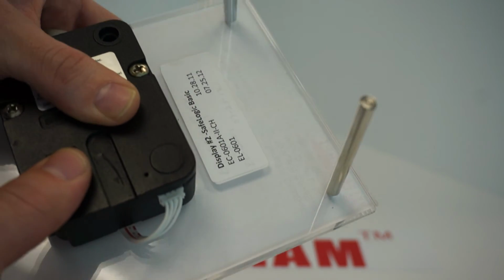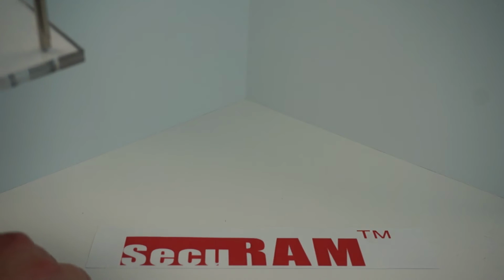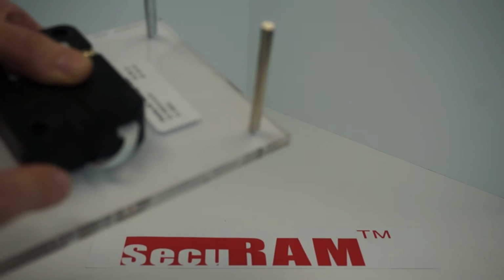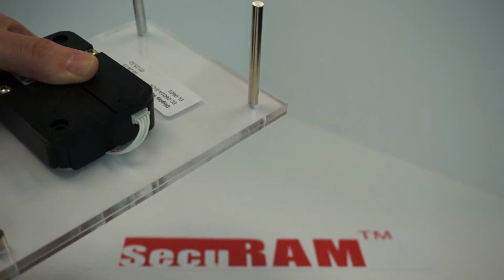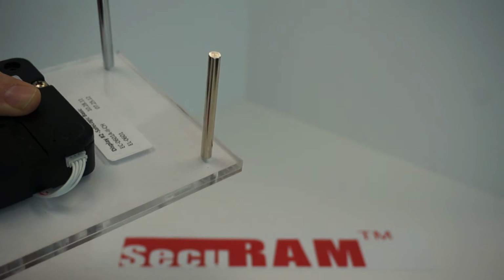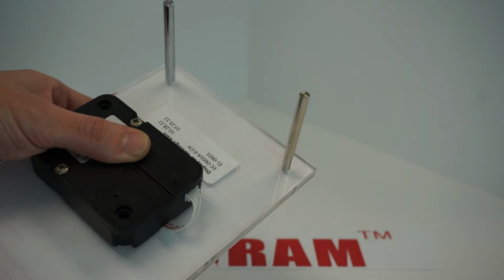Now this is extremely common for safe manufacturers and in general factories when they put together these safes, that sometimes they pinch this cable, and what it can do is expose that wiring and actually ground it to the safe, which can cause major problems right out the gate whenever you first purchase a safe.